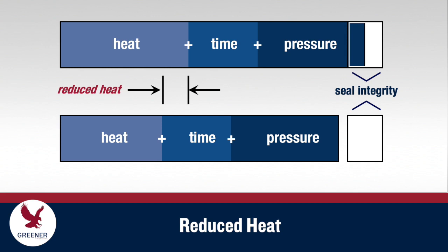The best method for improving hot tack is to reduce temperature settings so that the sealant layer cools below its melt point more quickly. Left as an isolated adjustment, reduced heat could cause poor seal integrity on the initial package seals.